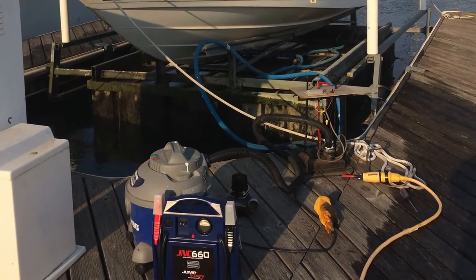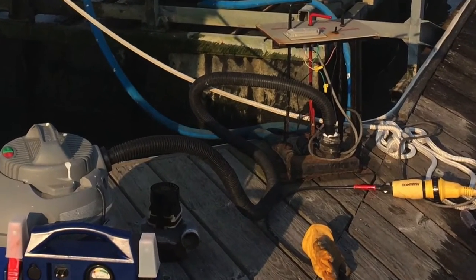This is how you inflate and raise your boat lift when you take out the motor — use a shop vac. You blow air out and connect it right there. You take a piece of paper towel, fold it up a little bit, and wrap it around the outside of your shop vac hose, just so you get enough for a snug fit inside that rubber hose that attaches to your boat lift. There's a rubber hose with two metal clamps. You put the end of the shop vac hose into that with the paper towel to give it just the right diameter.